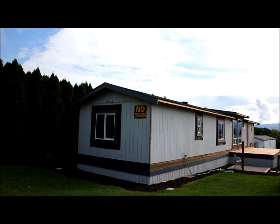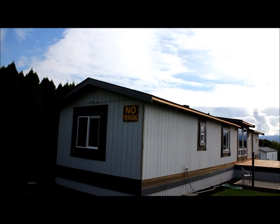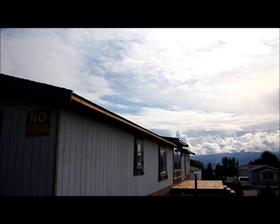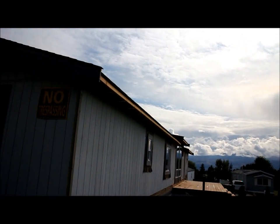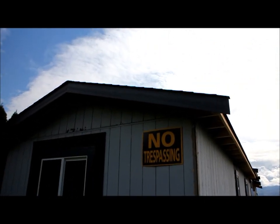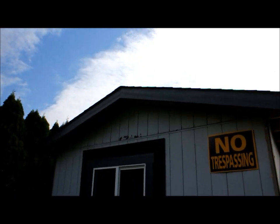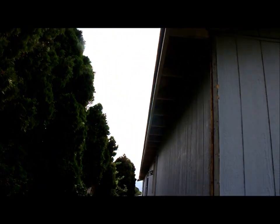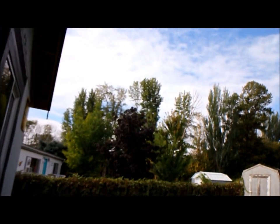We started off with a roof that had no overhangs, which you see quite often on mobile homes. We put an overhang on it all the way around — originally it just had the overhang at the front. We ended up with a 14-inch overhang and put these 8-inch fascias on. The next process is going to be to get the soffits installed and get ready to apply siding. Here you can see the overhang all the way around this side.